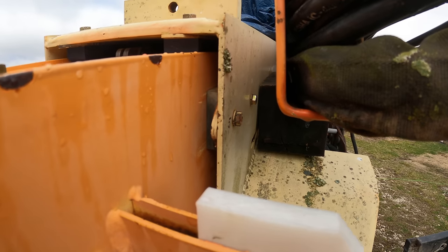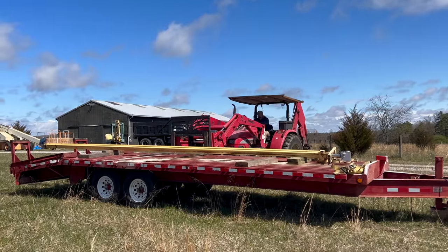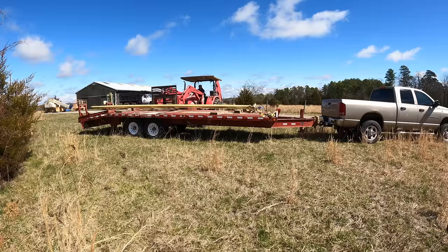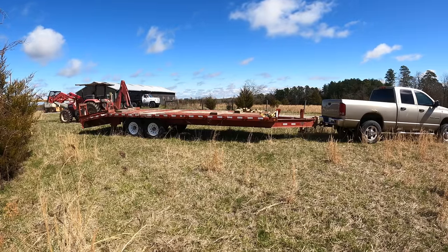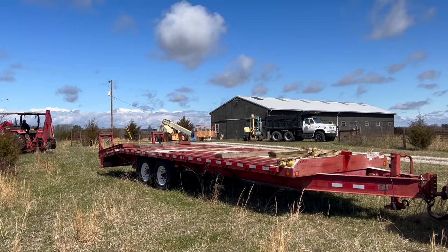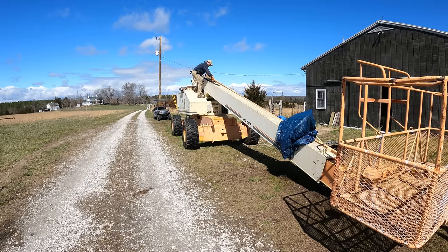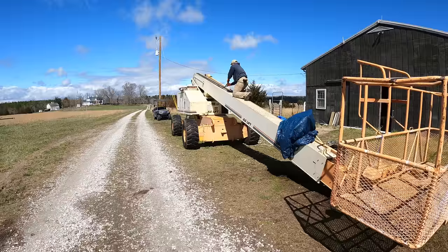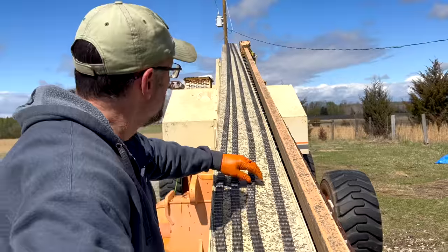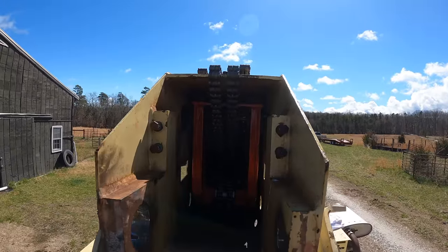I was able to push all the shims in by hand, so there's nothing jamming it like it was before. And the top shims also have about a 1/16 of clearance. All right, let's get ready to put this cylinder in. Now I need to finish pulling the extend chains onto the top of the base boom. Okay, we're ready to put the cylinder in.